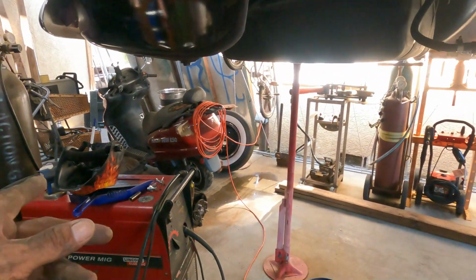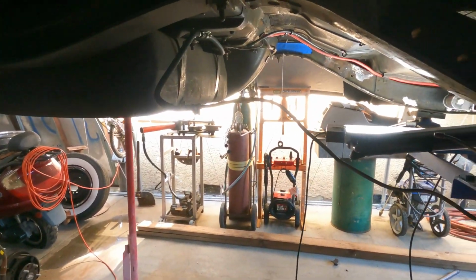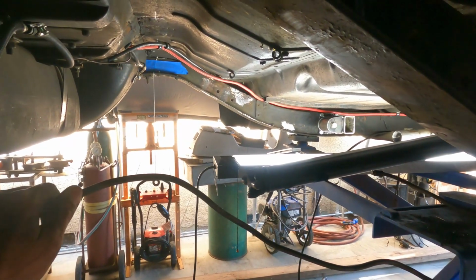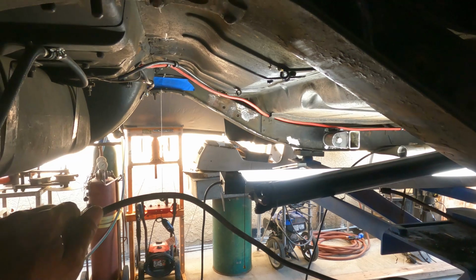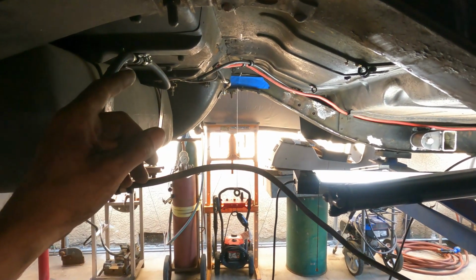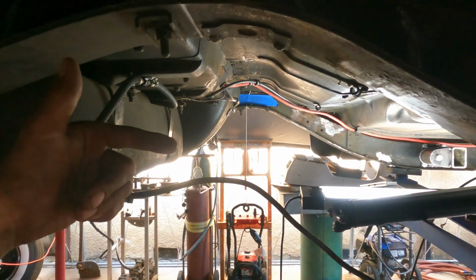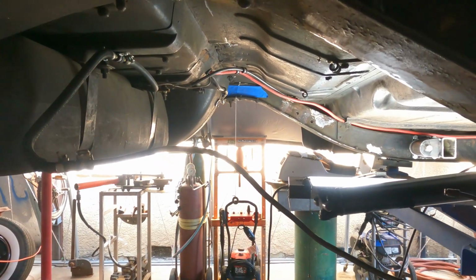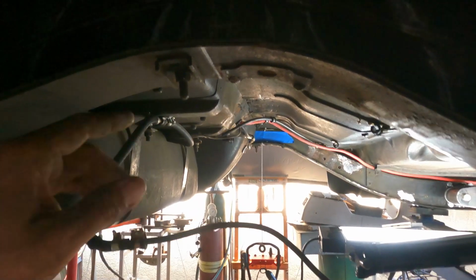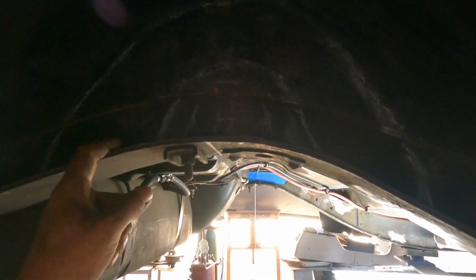And like I said, once those axle pieces are welded on there or tacked on there, then the rear end can go in, everything can be checked, and then once it's all checked, everything can come out, weld it up, and then I can work on a pan hard bar or some kind of something. Oh yeah, I have to work on that, and then the C-notches next too.